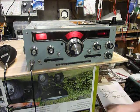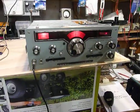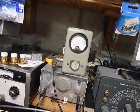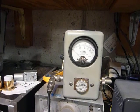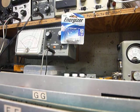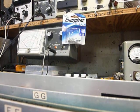I have in here now the original circuit board with the original resistors — this board has not been modified. I'm taking the camera off the stand and showing you the Bird watt meter. I'm turning the microphone gain control all the way up. Testing: one, two, three, four. I'm getting about a 30-watt indication on the meter. Now I'm going to pull this B-board out, turn the power off — out comes the B-board with the original resistors.